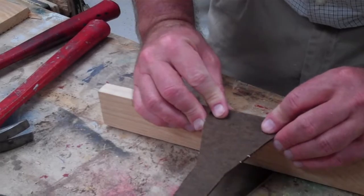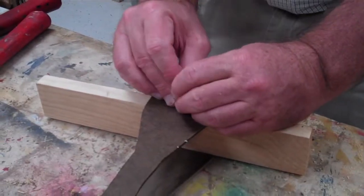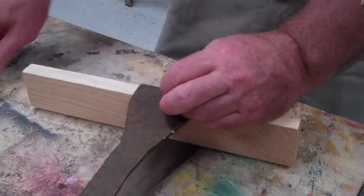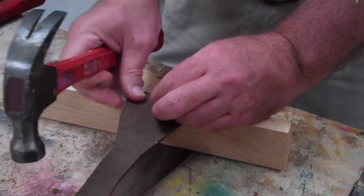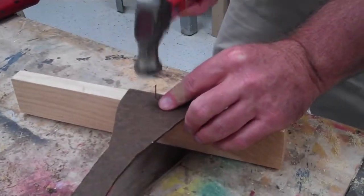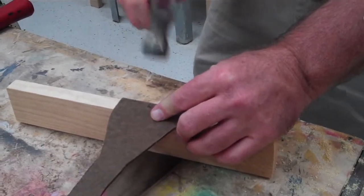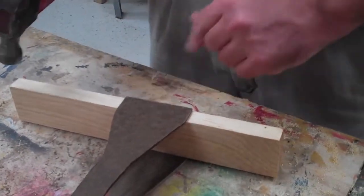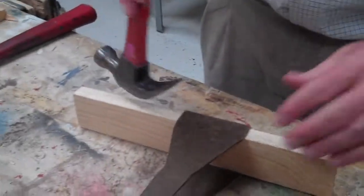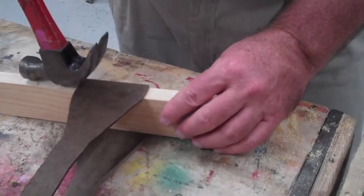Once you've got one side in, you flip it over and line it up so it's nice and level. Get another nail — you can probably put it in the middle; that might be a good spot. Remember, this is not a permanent fix, just temporary. If you hit your fingers, come see me and we'll get you some ice. If a nail is going in at a bad angle, you can try to get it in; if it doesn't go, that's fine — just take the claw end of the hammer and pry it out.